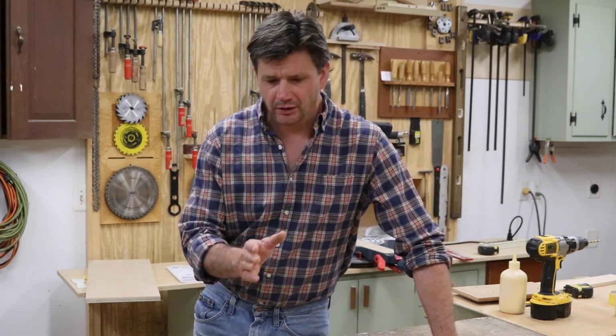Now, you may be wondering what will happen if I use the saw on a bevel. Well, if I have to replace the insert, then I will. But for the most part, I'll be using this saw with the blade in the 90-degree angle. And if I do use the bevel, well, like I said, I'll just replace it. It didn't take too long, and it just makes a big difference.